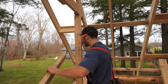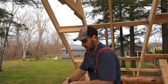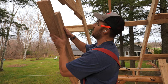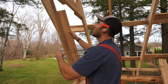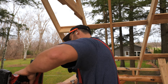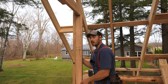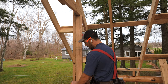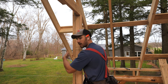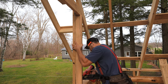That is my jack stud — this goes right there. And rewinding to what we were originally doing: this piece here is going to be where our siding butts up. Yes, I took a small detour, but at the end of the day it's still kind of doing the same thing. Here's how I like to do these — bring it right to our mark, toenail it from the outside, only put a couple in there because most of what holds this together is the siding coming up the outside. Toenail it, get it square, pop that in the top, and away we go.